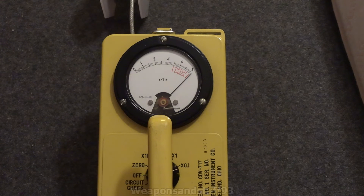I wonder if it's the cable that affects the needle speed, because on the CDV720 the needle shoots right across when you blast it — but that's beta sensitive as well, so the softer x-rays get through. What I'm going to do now is stop the video, reel in the cable, and assemble this in the exact same position but as a unit where the ionisation chamber is plugged directly into the unit, not running off the cable, and we'll see if that affects the sensitivity.